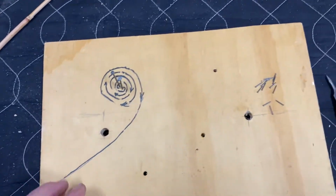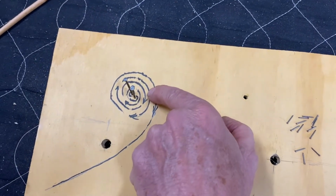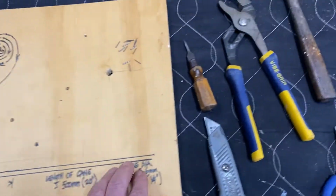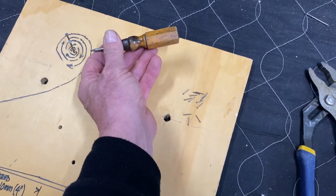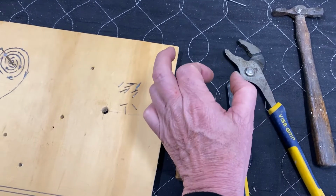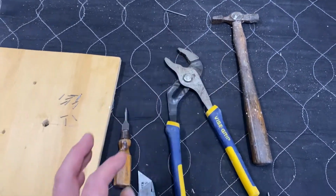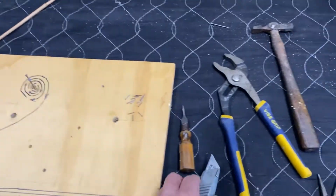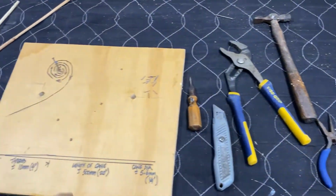What you're going to need is some little brads. That's to go into the side here as you go along, just to hold it in place. And the tools required, well, I use a little bradawl here just to assist me to pierce a little hole in there to fit the brad in. And then I normally use the pinchers to push the nail into the rattan, or you can use a little hammer, either way. Stanley knife naturally to do the tapering, just go along the edge. I've got a pair of pinchers, they just can come in handy sometimes to start off with.